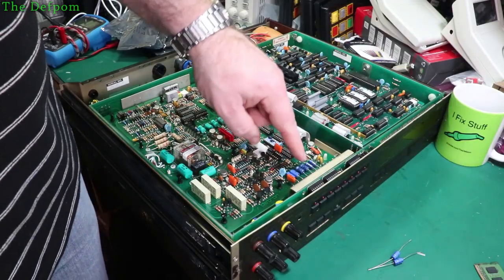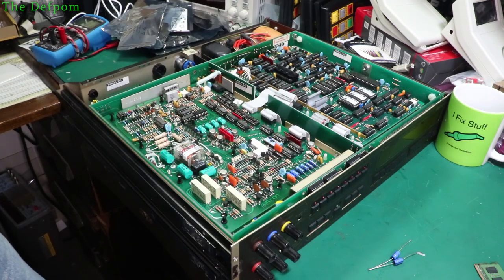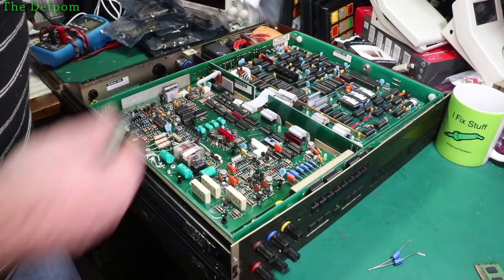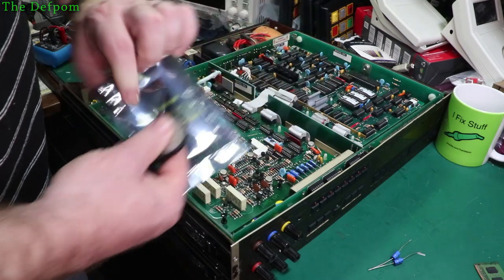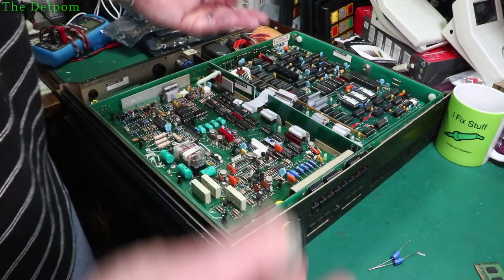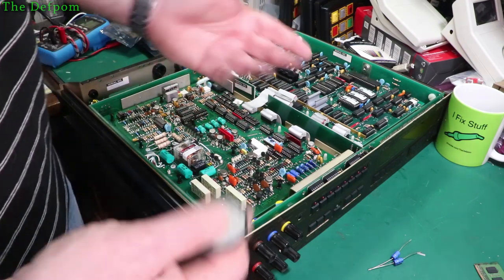The capacitors have turned up, so I can do the final two on the front here - that's then all of those electrolytics replaced, and now I can move on and check other things. Also the new opto couplers have arrived. This is the opto coupler I need to replace the one which is missing. So once I've got those capacitors replaced and the opto coupler installed, we can have a better go and see what happens - see if we're close to getting anything working. Make sure you subscribe, click the bell icon and give us a thumbs up.